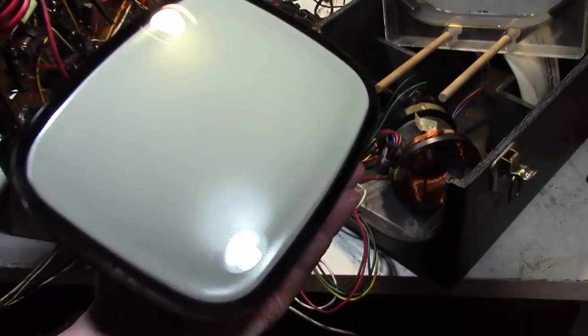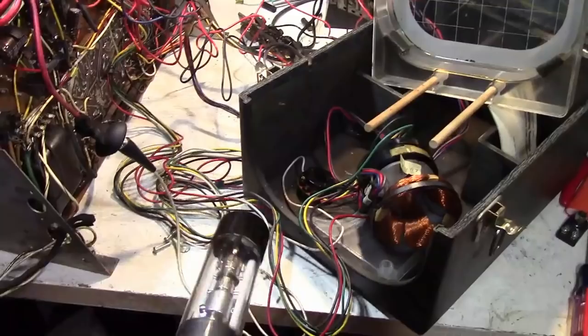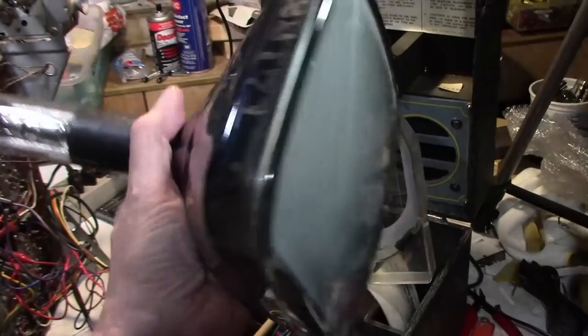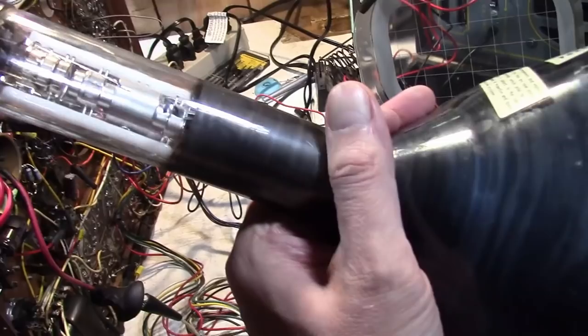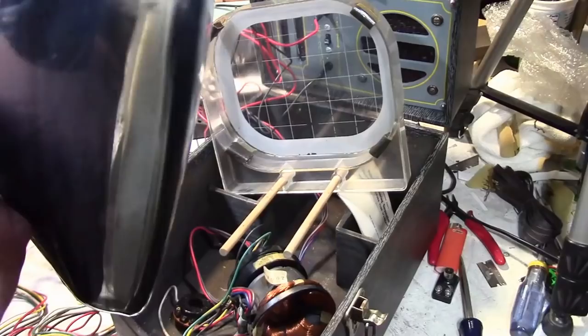Some of you may have noticed some junk on the screen — it was starting to drive me nuts, so I figured it's time to clean this thing out. And it gives us an opportunity to take a closer look inside. This is the CRT — something I've referred to in the past as a test CRT. What it is is an 8-inch black and white picture tube that's kind of designed for servicing TVs. It's a bit more rugged with respect to the electron gun design — it can handle in excess of 20,000 volts. And it also does not require an ion trap, but it does not have an aluminized screen. It's just a straight electron gun — no nonsense, straight through.